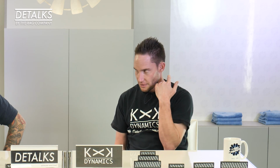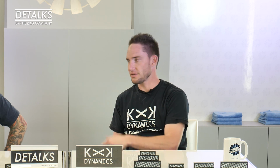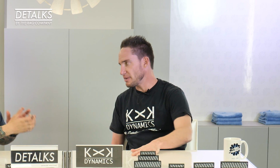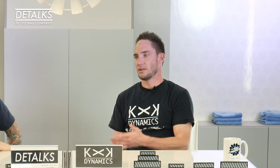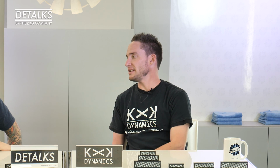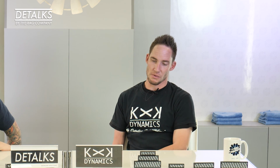And watch your sandpaper. Listen for the grit. If there's grit or you hear it, stop and flush the surface out, because all you're doing is digging in a piece of debris, whether it's a piece of dirt, a rock, a pebble, or even a piece of dust. So that would be a don't.